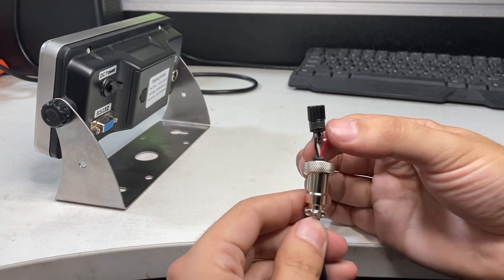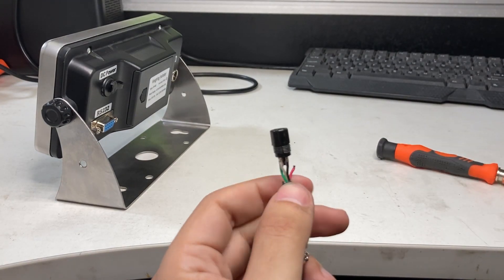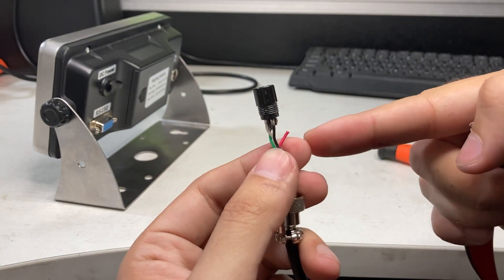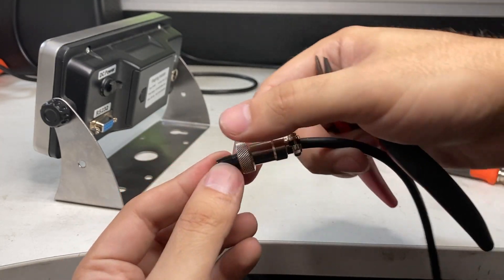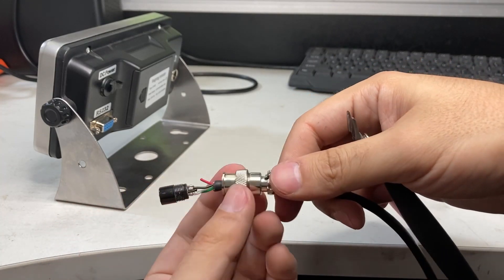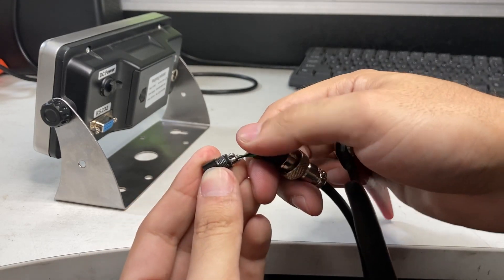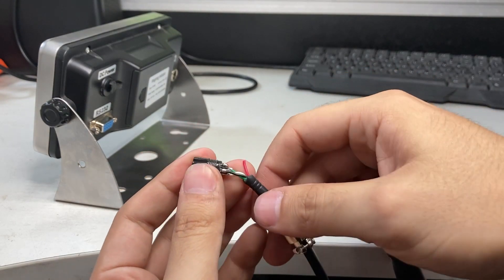To fix this, you're going to have to cut a little bit of the wire. You can see some of it broke off — this happens when someone yanks the cable from the actual cable itself rather than from the metal housing. I'll demonstrate: push strain on this end, pull it a little — yanked out, broke off.